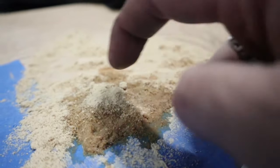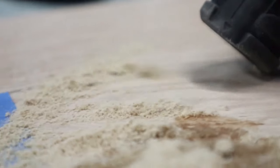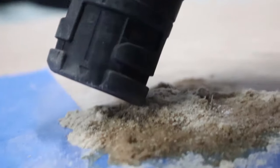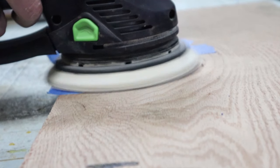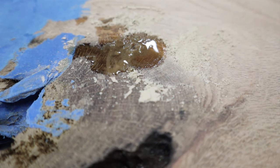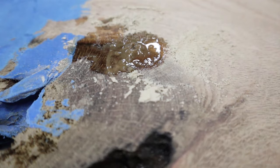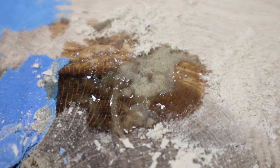We've got a little swamp fire going on here. Please, please wear a mask when you do this and be in a well-ventilated area because this stuff will mess you up. Before you vacuum this up, make sure the chemical reaction is fully finished — do not vacuum up hot embers into your dust bag, that's a recipe for an explosion. After secondary sanding I find one little area left to fill. This stuff will literally make your eyes water if you're not careful — do not hover right over it.